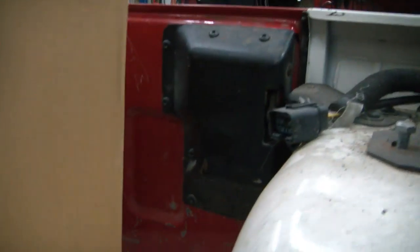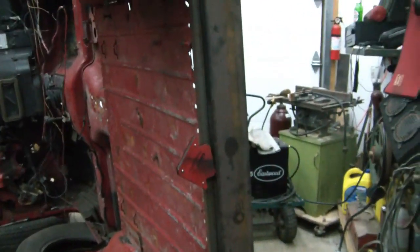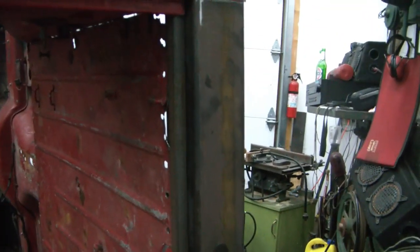to the fender well. Another thing is, look at the gap between the bottom of the tailgate and the top of this bump in the floor. And I'm pointing this out because this is 3/16 shorter than this piece of 3/4 inch box, and I think there's more than enough room to accommodate that. So, and the gaps are nice here, so I think I'm gonna leave that 3/16 proud.